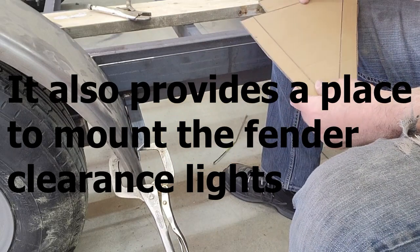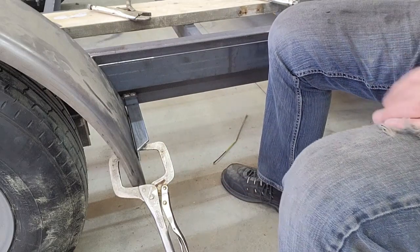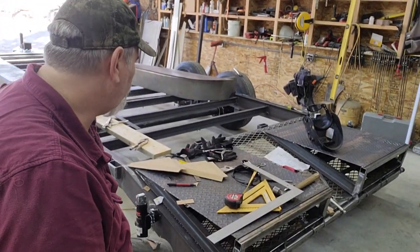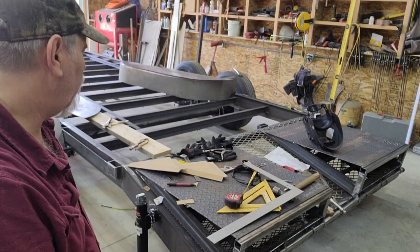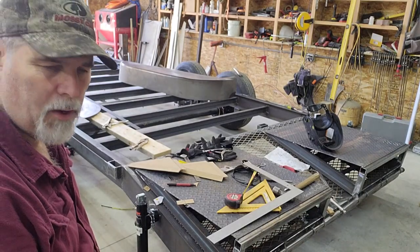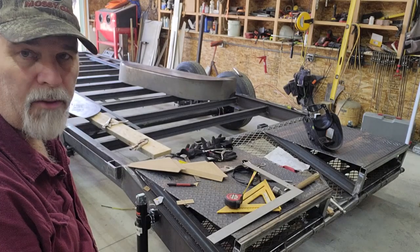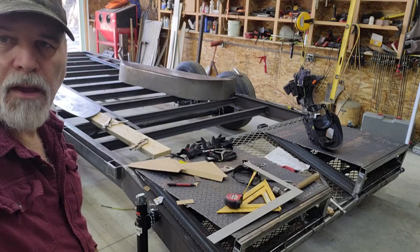And the nice thing about doing another cardboard is then you just unfold it flat again and lay it out on the aluminum and cut it out of aluminum. So I'll get those either cut out, or at least I'll get it set up. I haven't decided if I'm going to cut those out on the bandsaw. The metal cutting blade on my bandsaw is really dull, so I don't know that it's going to cut aluminum. It was a hard piece of carbon on a piece of steel that I cut, and so it pretty much took the edge off all the teeth. I'll probably do it on the plasma cutter, because it cuts aluminum really nice, and you can zip through it like butter. So I'll bring you back once I've laid it out and decided how I'm going to cut it.